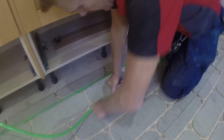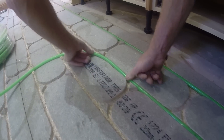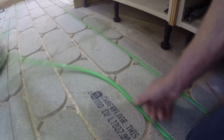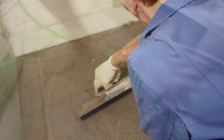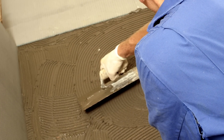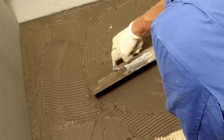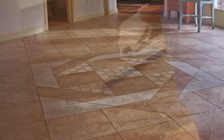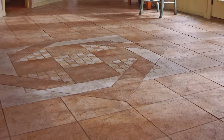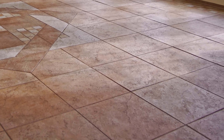Insulation is a key thing — the more insulation you can get underneath underfloor heating the better off you're going to be. The last thing you want is heat escaping down through the screed. That's why it's almost criminal when you see people putting electric heating systems on top of uninsulated concrete floors and just tiling over the top — that wastes a huge amount of money. In fact a guy down the road from me had that system done, ran it for one season, saw his electricity bill at £1,500 for the winter, and never switched it back on again.